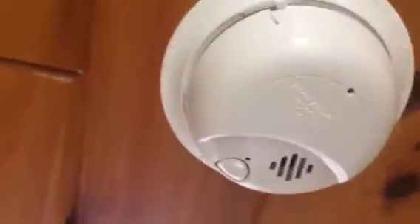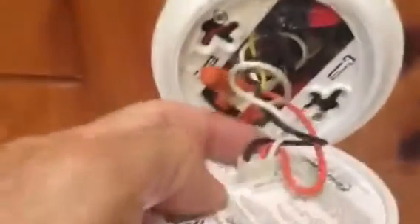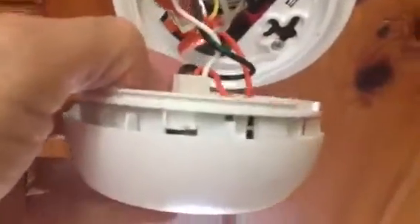Personally, if I'm doing a lot of work like that and it's the smoke detectors upstairs, I may just take a step ladder and counterclockwise rotate this and take the whole thing down. There's just a little plug here that will just unplug and allow you to work with the battery down at ground level, but that's up to you. The only thing you got to worry about is don't mess with these wires too much because they are 110 volt and you don't want to get a tingle.